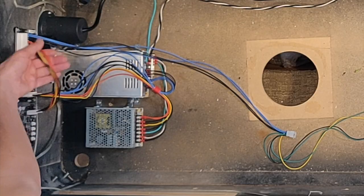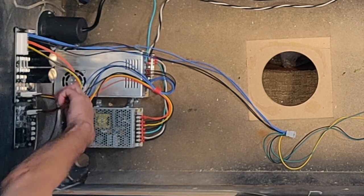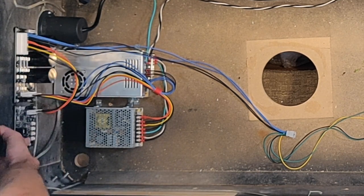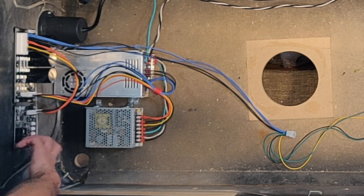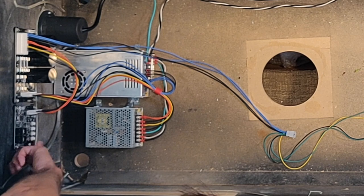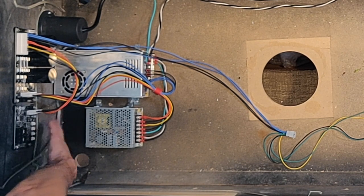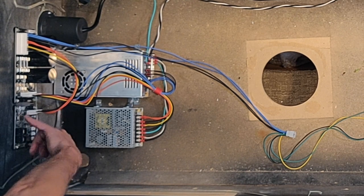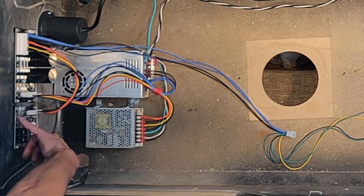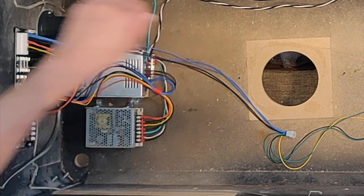Today, we're going to get power coming out of the power filter board. With this connector here, we've got five wires coming out, and they go over to our Nano controller board. This is where we start the communication with the loop network. We handle our lower power items, such as our 5 volts and 12 volts for our LEDs, everything else we're going to do. It's also the connection to our computer. So we've got a micro USB port here. It's kind of the guts of the system that you need to get going.